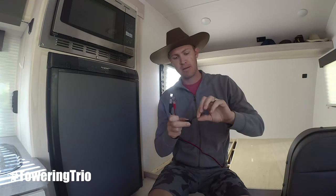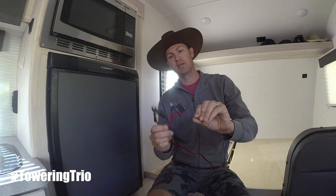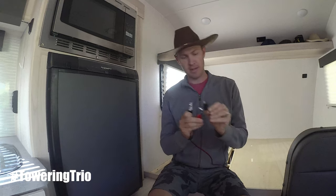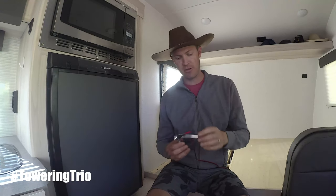What you want to do is pull out your sail switch and use a set of jumper cables. These jumper cables are wired into the two wires that go to the tabs on the sail switch. Basically, the two wires are connected where the wires come out of the control board — there's no sail switch in between. You could take the jumper cables and hook one up to each tab, then manually actuate this switch and close it. If you do that and your furnace moves into the next sequence, you'll hear a click — that's the igniter lighting the propane — and then you should get hot air a few seconds later.